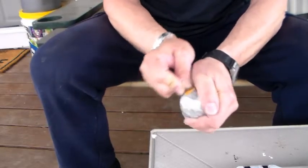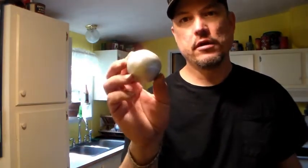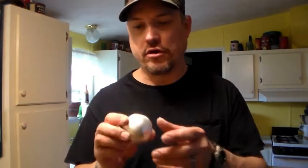Well, on my first sanding I tried to use my hand sander with 40 grit, but I went up to the 60 grit. Wait, let me start over. I was hand sanding after I pounded it flat. I hand sanded with 60 grit, and I worked on it for an hour and a half, and this is what I got so far. And now to work up, I'm going to go to 80 grit. After the first initial sanding, I don't think it's going to take as long.